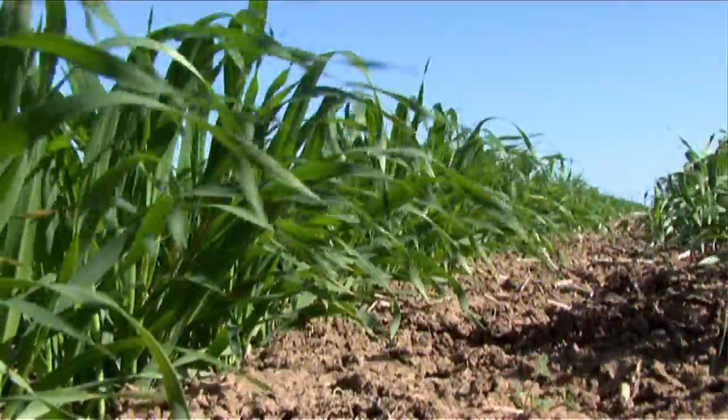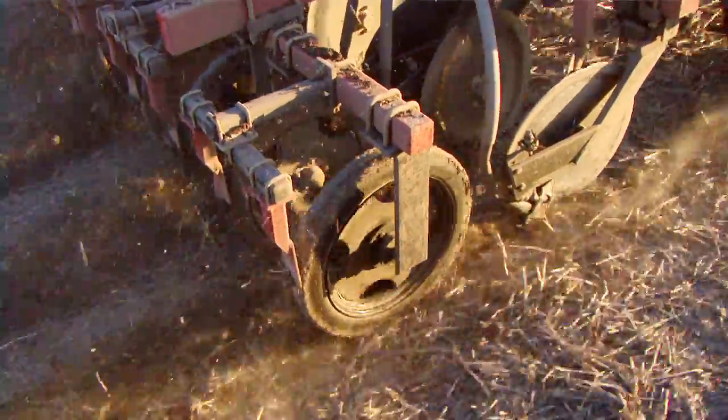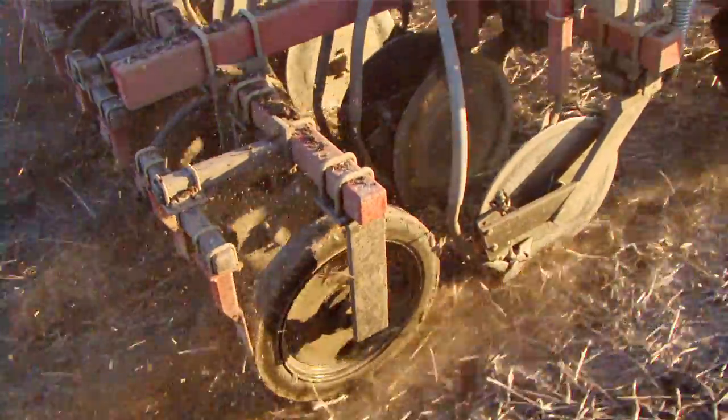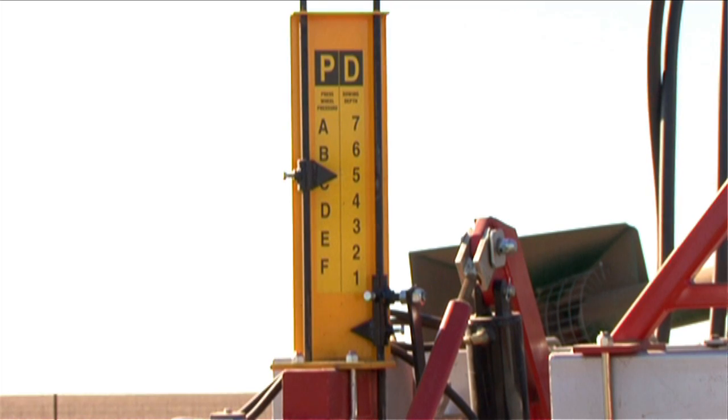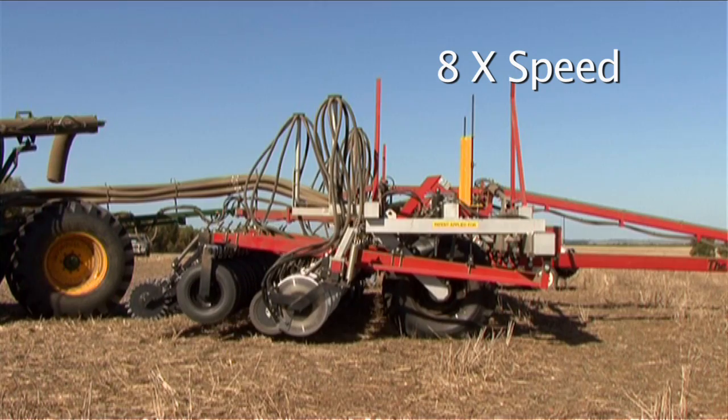The press wheel setup is very good — that was one of the major selling points for us. It's so important to get the seed-soil contact and to get the air out of the soil around the seed. With the big thirteen inch press wheels you can push it in so easily. You can put as much pressure or as little pressure as you like. With wheat and barley, which are our main crops, higher pressure is definitely better — you can't really over-press wheat or barley. With canola you can't press as hard, so we back it off. Most machines can't adjust press wheel pressure, so it's a major benefit.